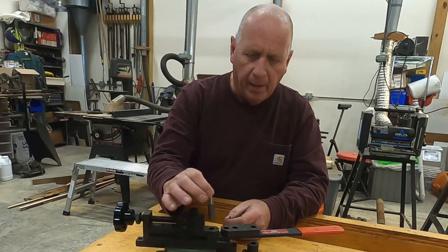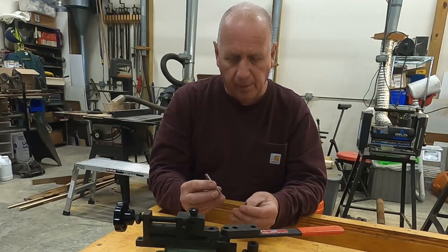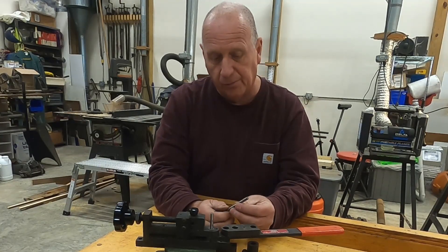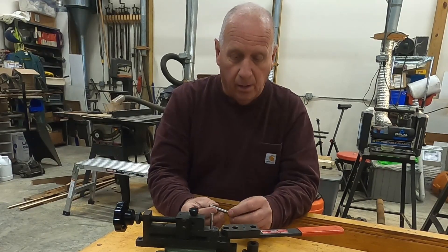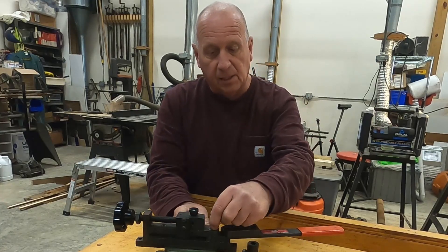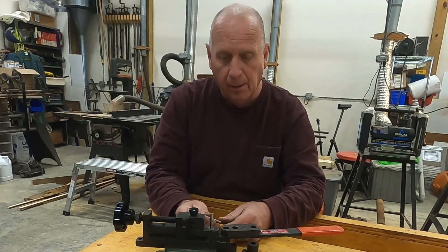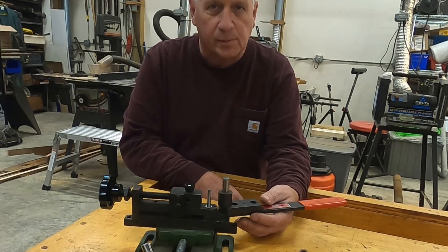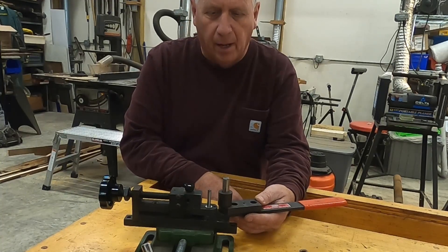For this video I made a quarter inch die for this machine, but these dowel pins come anywhere from a sixteenth of an inch up in increments of sixteenths of an inch - some of them are thirty-seconds of an inch. So in theory you can make a die that's a sixteenth of an inch in diameter, though you may have to be careful bending something with it as it'll probably break. If you like my video give me a thumbs up, and if you want to see more videos like this subscribe to my channel and send comments - I'll try to reply.